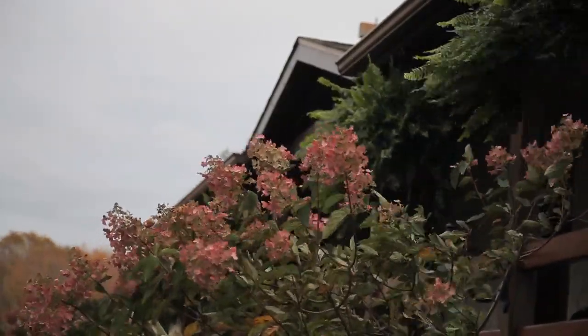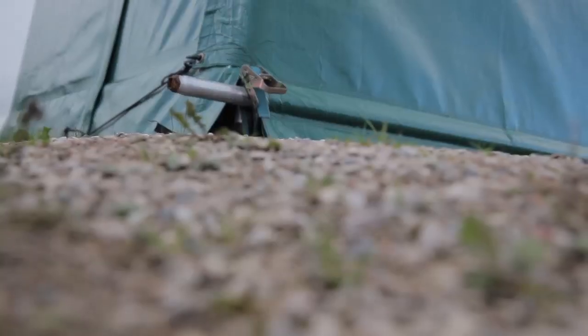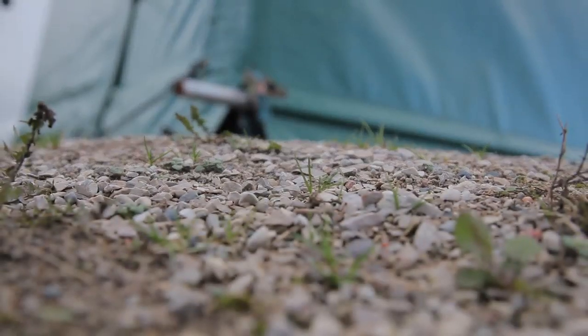So here's a quick tour of my shelter, some tips on site preparation and assembly that I learned from my own installation, and technical reasons why I expect this shelter to hold up for a long time. I chose to install my shelter on a raised pad of compacted limestone screenings. You could get away with putting yours on grass, but an aggregate base means freedom from mud and ensures that water doesn't drain into the shelter underneath the walls.